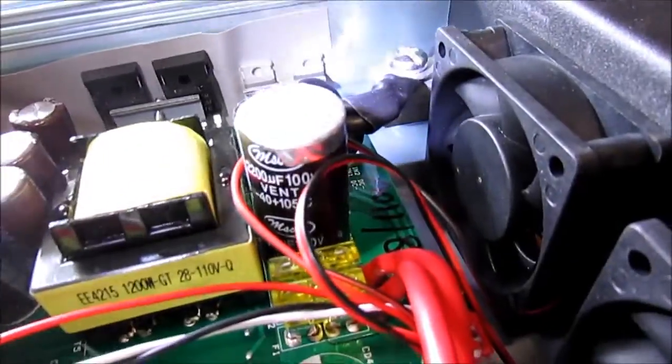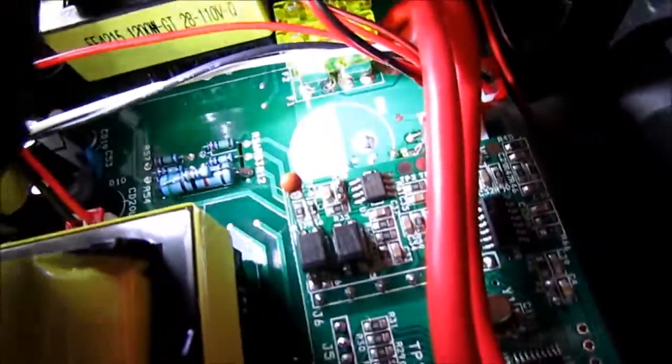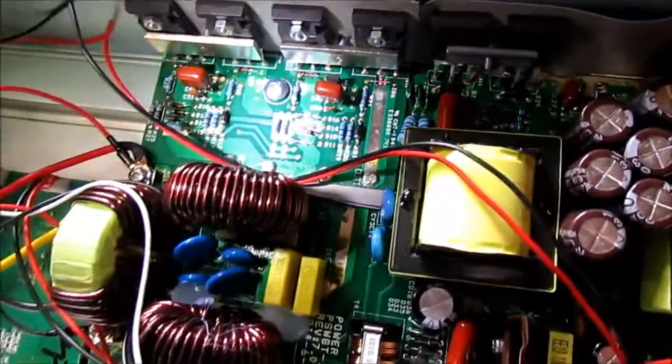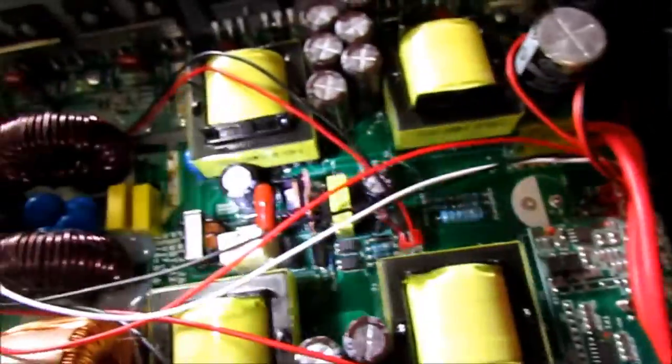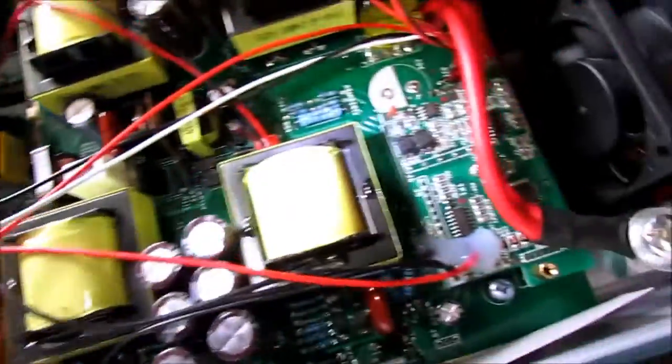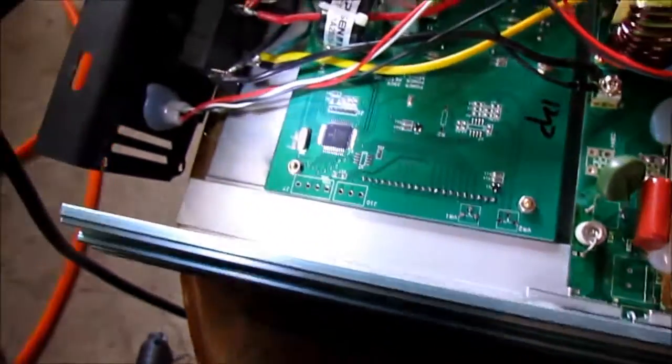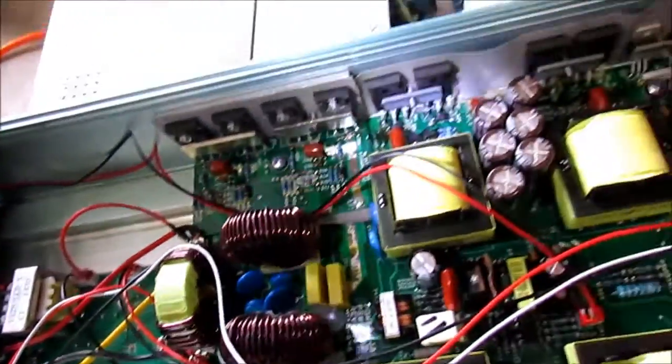It's just funny stuff like that. There is an option for another nice big capacitor right there — I might add one later to see if that helps performance. The board's pretty dirty. And it's funny — that resistor has a small resistor stacked on top in parallel to get the value they wanted. Kind of funny, stuff I haven't seen before. Not too sure if it's uncommon or just super sloppy, but that's this inverter.